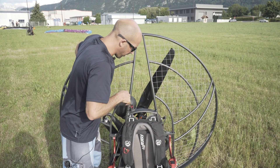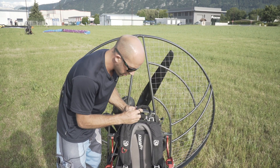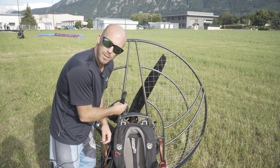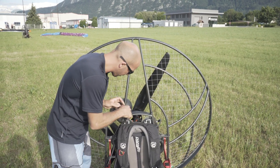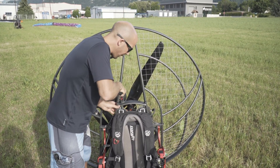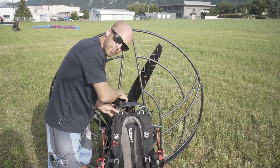First thing is the pull start. We're going to go from top to bottom. I want to make sure that this knot doesn't come undone. If it does, my pull start system is going to wind itself up and it's going to be a pain getting it back out again. Just make sure that's all in good condition and it's not starting to deteriorate on the lines. There's no friction, there's no damage to this. Also pull through very slowly — you should be able to feel compression.